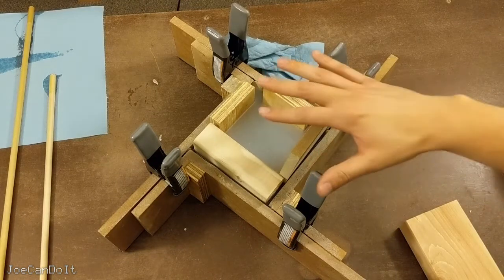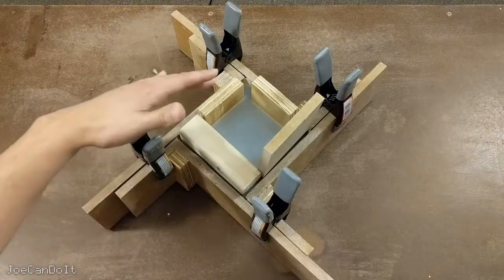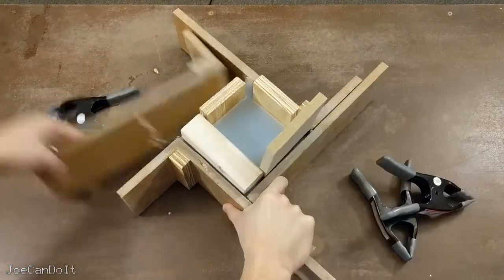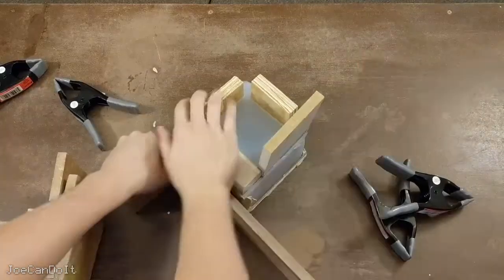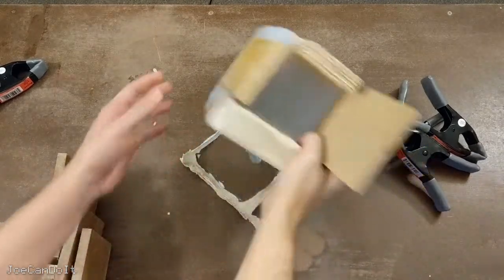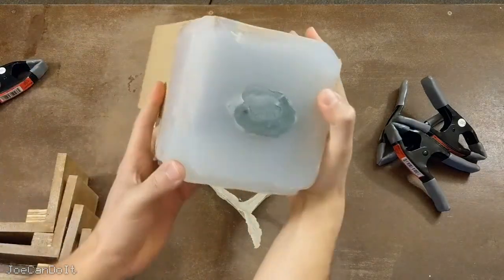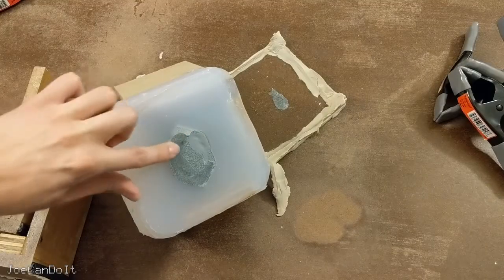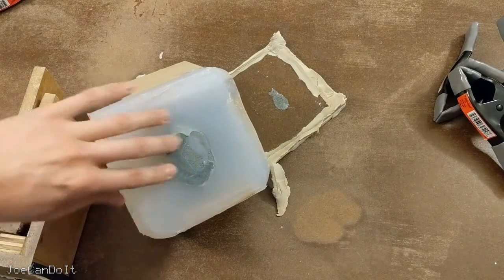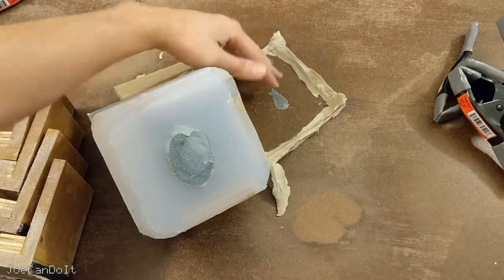It's about 18 hours until I could demold this, but I'm going to wait the full 24 hours just to be safe. It's now about a day later and the silicone is pretty hard, so let's see what's inside. There's the clay underside and the part. I'm going to cut out any silicone that leaked underneath so the object has room to break free. Also, some pieces of the object stuck to the hot glue and stayed on the table.